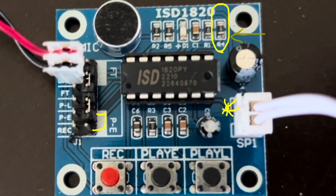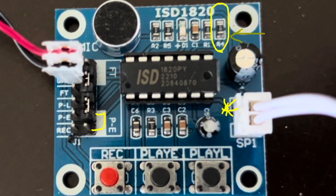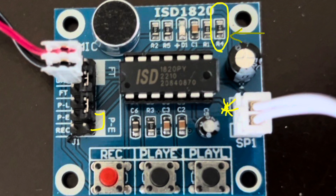The first thing I did was basically change the speaker. When I first hooked up the speaker, it was pretty quiet sounding. I got rid of the speaker altogether and just put an output line where that little asterisk is — there's a pin there that can be attached to an output line. Also, a switch can be attached between the P and the E on the left side of the board.